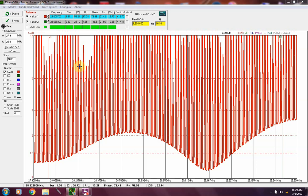So, if you had the room to put up only a 160 wire, you could also use 60 meters, 12 meters, 10 meters, and 6 meters off of that one wire. In my case, the only two of those that would be usable would be 160 and 10, because those are the only two in that list that I have a radio that I operate on.